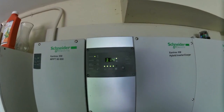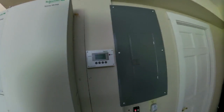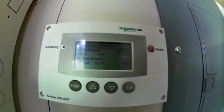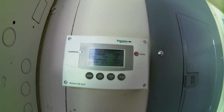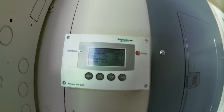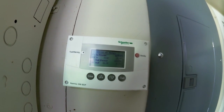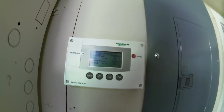There she is — she's at 3.1 kW now, so it jumped up about 300 watts. Incoming power is now 3,670 to 3,700 watts, and voltage went up from the 220s to the 250s. So it added about 300 more watts to the array — about a 10% increase, a little more.